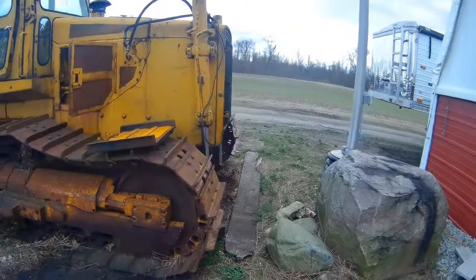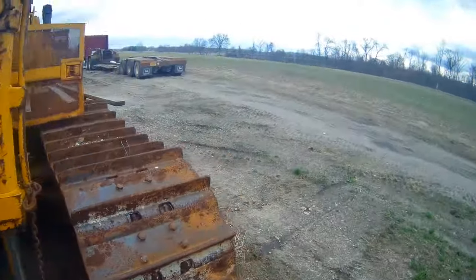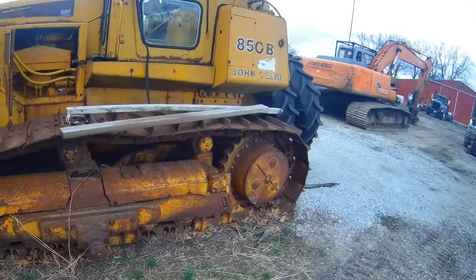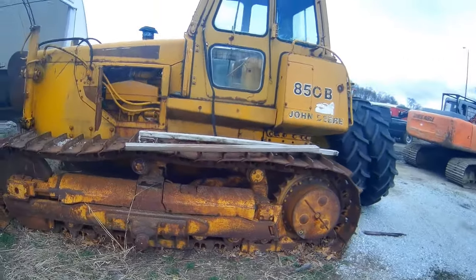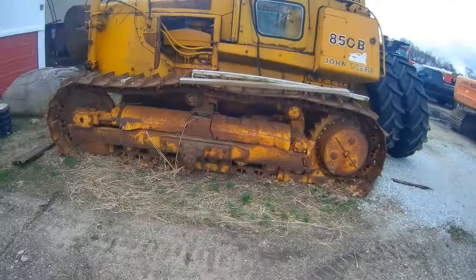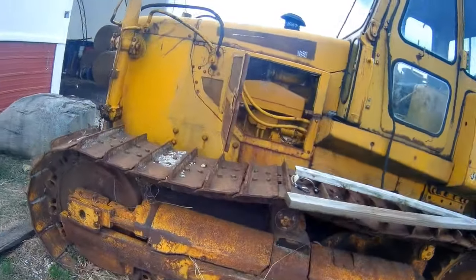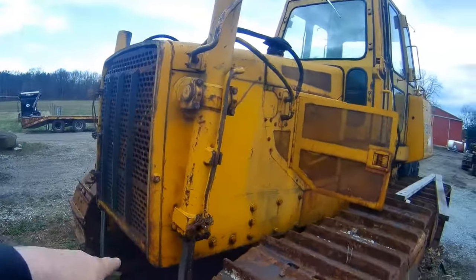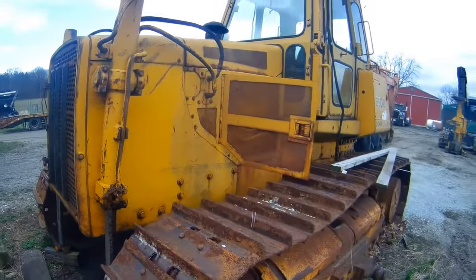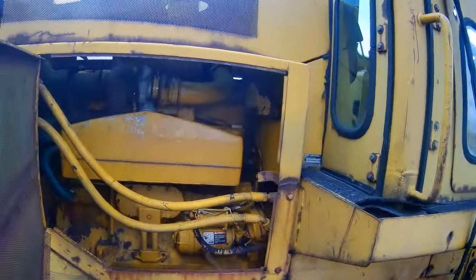My uncle Jamie had a good idea — he's got a 12-volt hydraulic pump for a dump bed on a truck and he let me use it, so I'm going to plumb it in so it'll run constantly and I don't have to pump the porter power. That way we can roll it into the back doors of the shop so the hard nose and stuff is facing outside, and we can back in with the service truck crane and pick the hard nose off — both cylinders and all the radiator will stay in there. Should be about a three-hour job to pull this motor out.